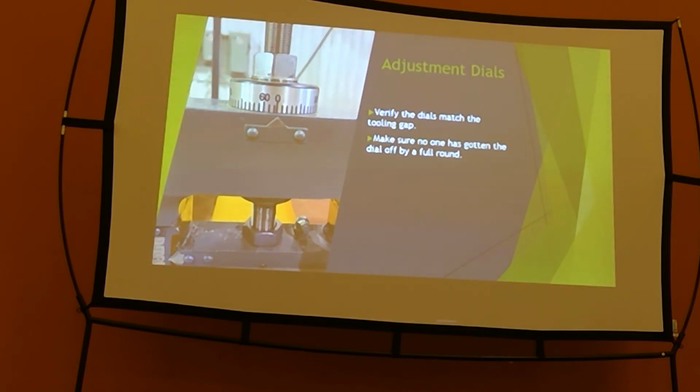This is something that kind of gets overlooked a little bit, and we see that if those adjustment assemblies get worn out, the threads inside of that assembly get worn. We have extra slop in the bearing, more bounce, more bounce. As that panel comes through, it's going to jump, top and bottom, top and bottom, starts wearing more and more. That transfers to bearings, it transfers to arbors, it transfers to roll tooling.